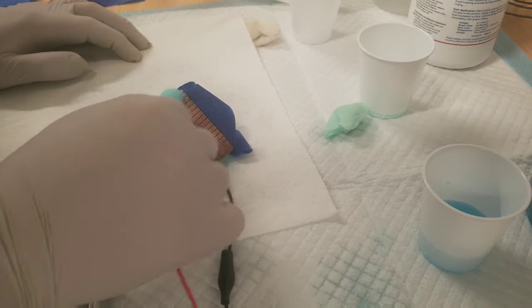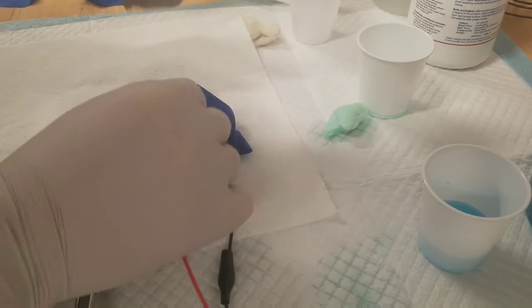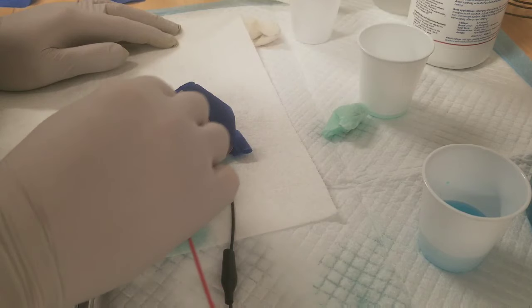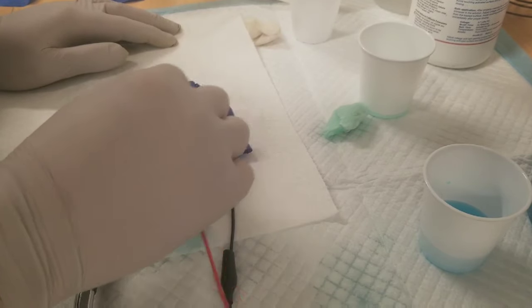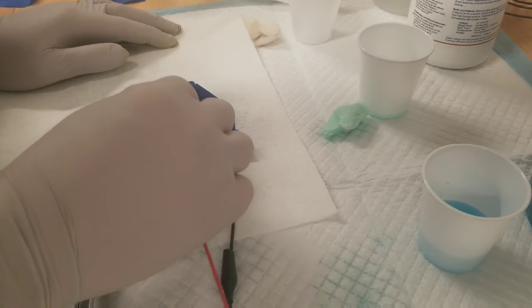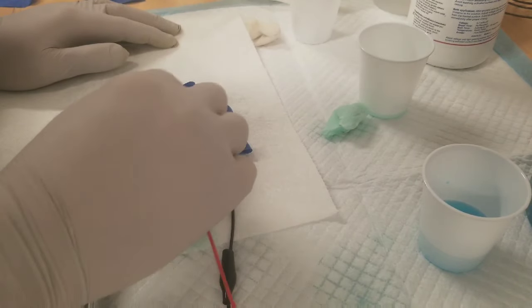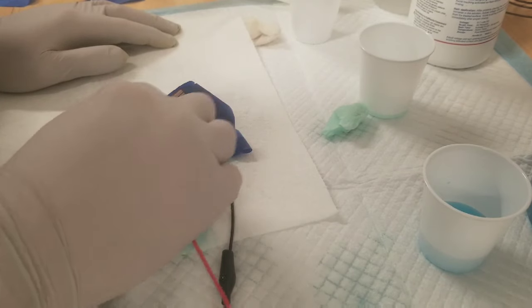Now, this is the brush method. There's a bath method, and that's what I did with the Mizuno. I did all of these steps previously with the same method, but when it came time to actually do the bright nickel, I used a bath method, which is I just took a little bucket. And I had a nickel anode, which is just a big piece of nickel, and I connected that to my positive lead, and I had the negative connected to the club, and I let that sit for about 20 minutes. And that thing came out sweet.